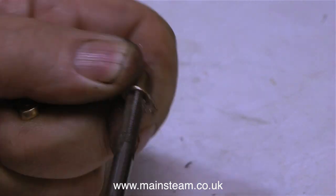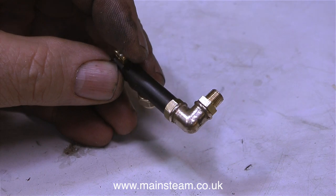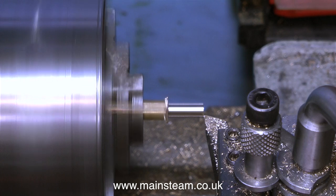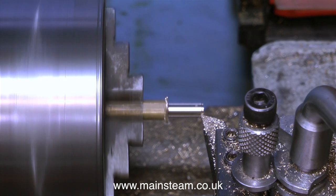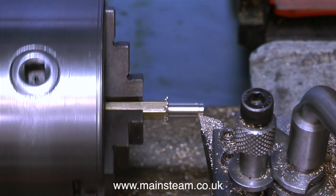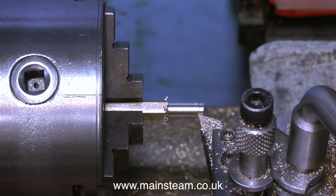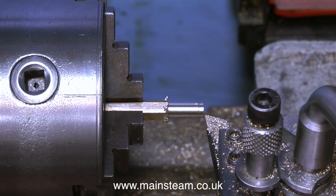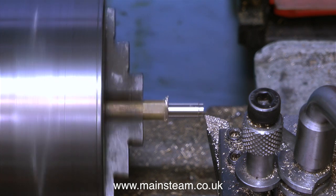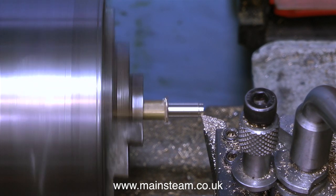This very small bit of extra work is not an issue. When you look at this on the valve it really looks like the assembly belongs on a steam engine. Over on the lathe I'm turning down a piece of brass to a quarter of an inch in diameter to make a very simple thread adapter. One end fits into the elbow and will be Loctited in place, and the other part screws into the end of the turret. According to my micrometer it's nearly there, so I'll take a very fine cut all the way down and then thread the piece of brass.